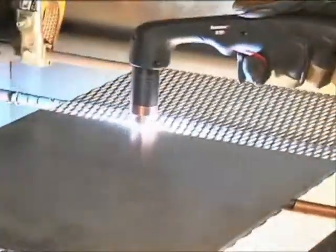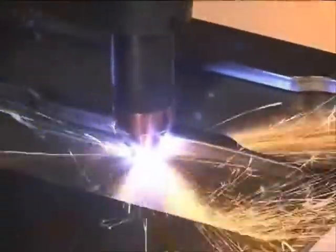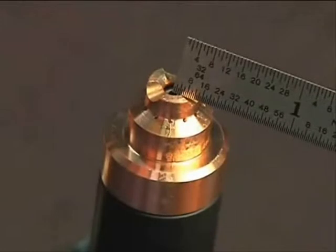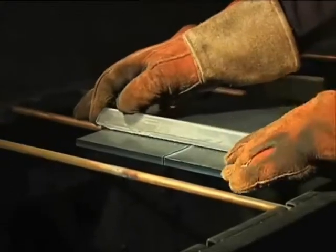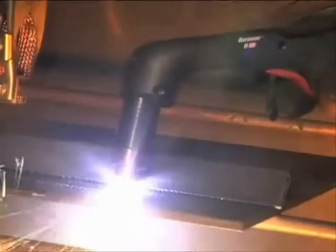Lag lines on the finished cut edge should also be about 15 to 30 degrees. A plasma cutting guide, straight edge, or template can be used to guide the torch. However, the distance from the shield center to the edge must be factored in when creating a template or placing a straight edge. If beveling using an angle iron plasma cutting guide or freehand, remember that the material thickness increases proportionally with the bevel angle.